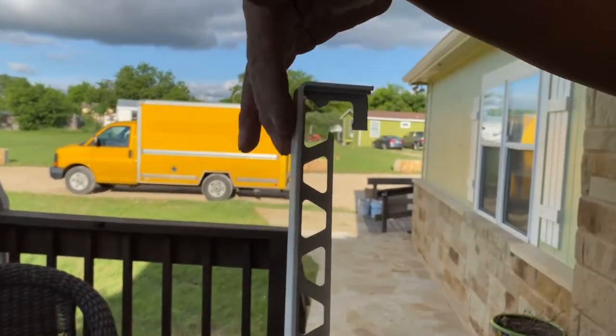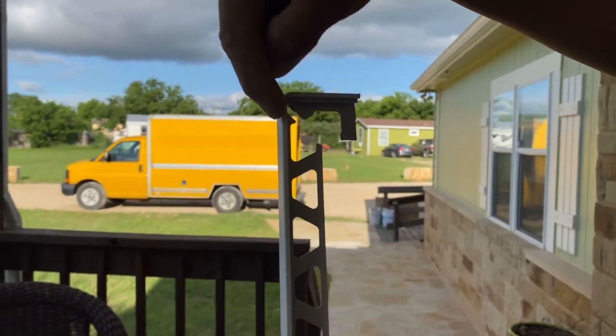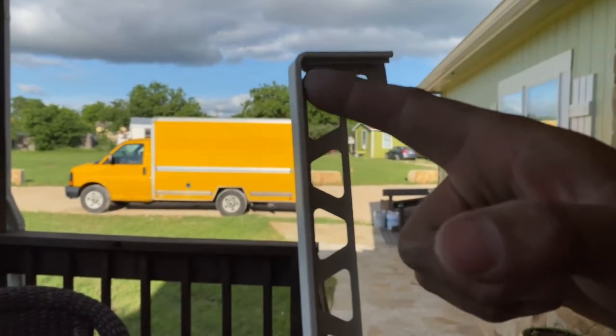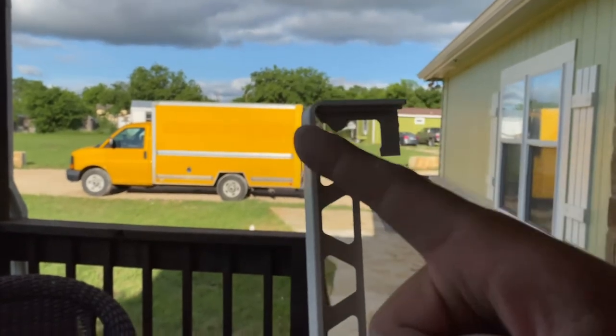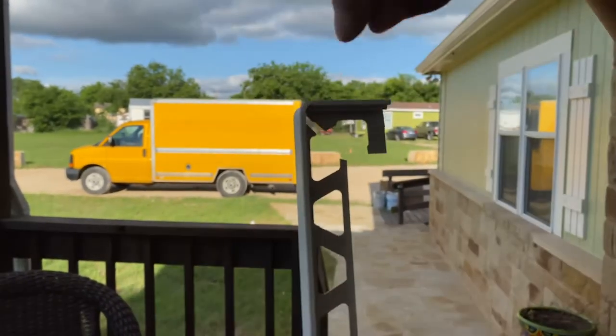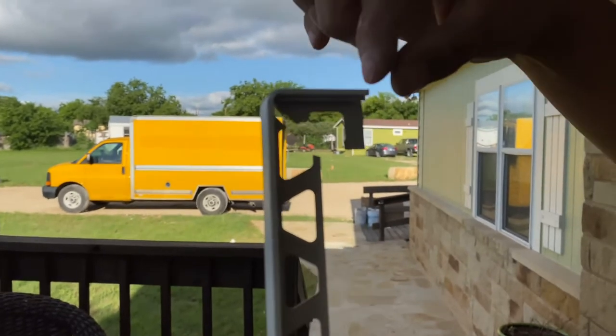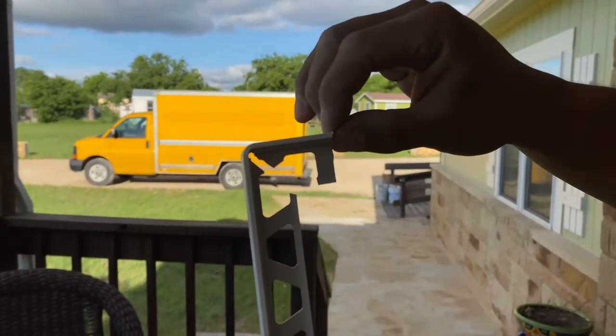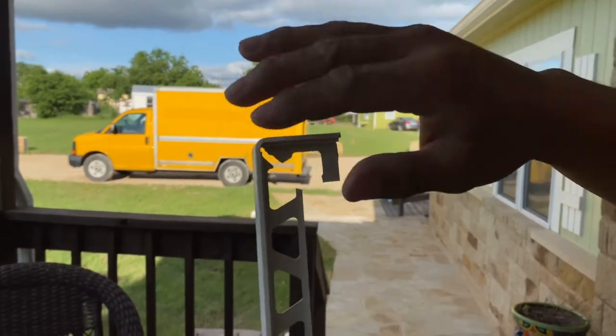This is the edge of the wall. For the second measurement, I measure from the outside — that's very important. Always make sure whether you're measuring from the inside or the outside because there is about an eighth of an inch difference. If you don't measure correctly you could come up short. It's okay if you're long because you can always trim it, but if you're short you pretty much have to start over.